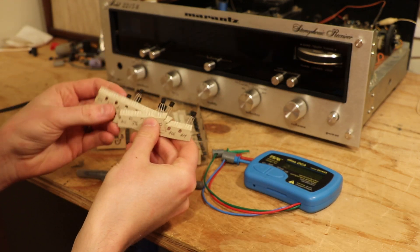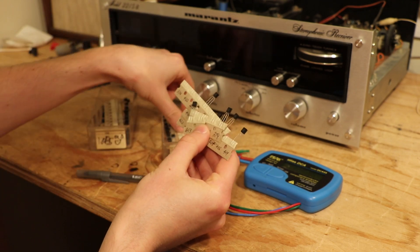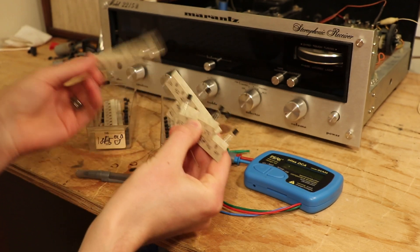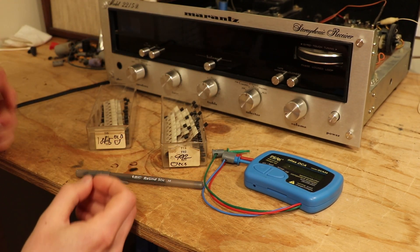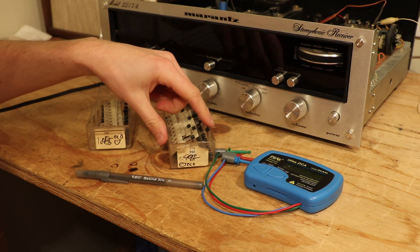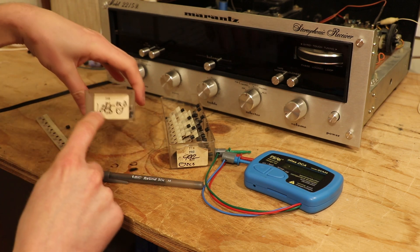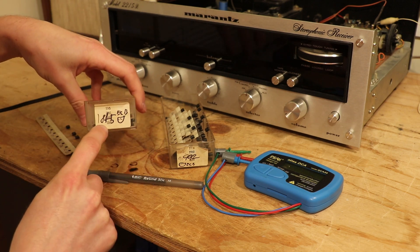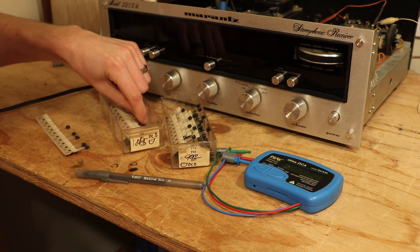As you can see, I'm getting a little low on the transistors that I can make pairs with anymore because I've run out. So now's a great time for me to do a little video on how to find matched pairs. I'm going to work on my 1845s — that's a KSC 1845 by the way, a part number you can find on Mouser. Just type in KSC 1845 in the search.